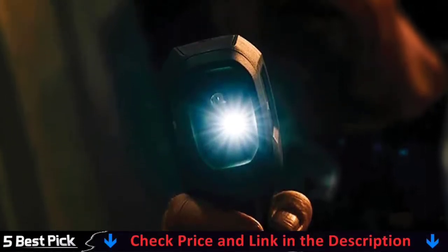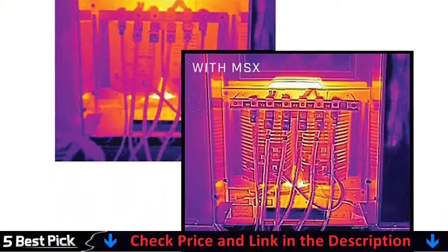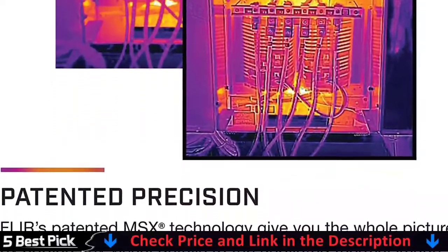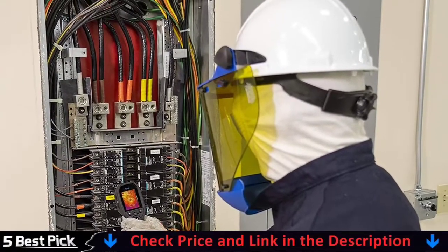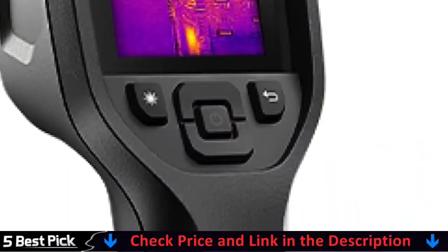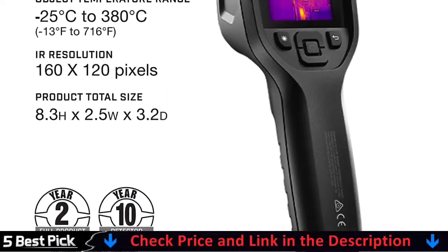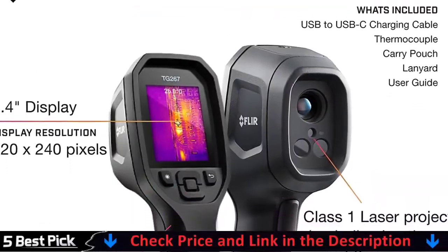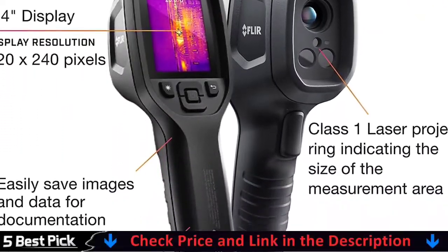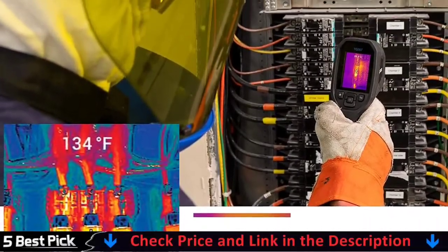The FLIR TG267 is built to last, so it's a good choice if you intend to use it outside frequently. Its accuracy in average temperature conditions is plus or minus 2.5 degrees Celsius, which is quite good for this price point. The thermal sensitivity of this device is average, but the resolution of 160 by 120 is quite low, and the screen is significantly smaller than our best overall pick, making it difficult to see fine details in each image. Nonetheless, for the price, it is an excellent choice.